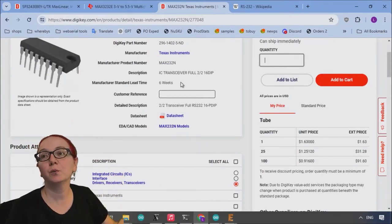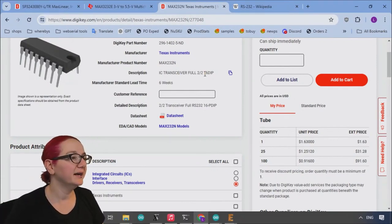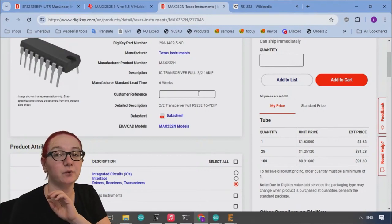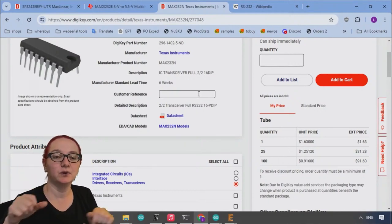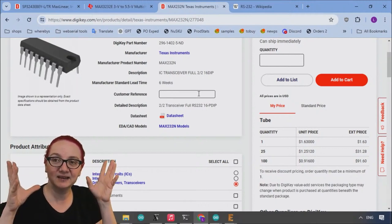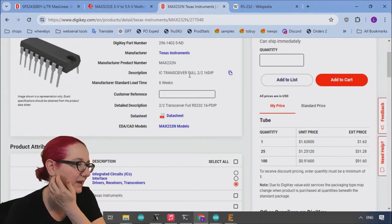This is a transceiver with two — it's full duplex, which means it has RX and TX: 2 transmit, 2 receive. On chips like the original Arduino, which also uses serial, they use the DTR pin to do an auto-reset. When you opened the serial port, the DTR pin would toggle — that's the pin that indicates the serial port is open — and that would immediately reset it, then the bootloader would run for three seconds and you'd upload.